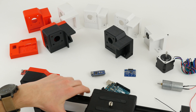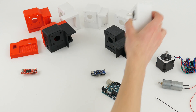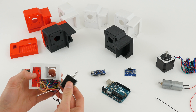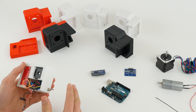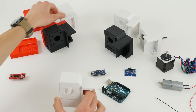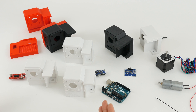Now, here are some of my earlier prototypes. Here is my very first prototype, which uses a NEMA 11 stepper motor — a lot less powerful than the NEMA 17. At first I thought it would work, but after several attempts it didn't move the slider at all, so I went with a NEMA 17. Here is the easy driver and the space for the Arduino. Here are the following prototypes using the NEMA 17, and although it doesn't look like much improvement was made, quite a few things changed in every generation — and this is probably only a third of all the prototypes I have.